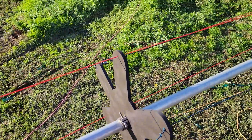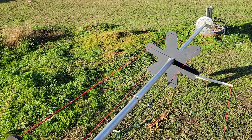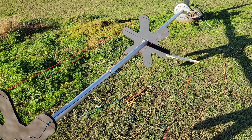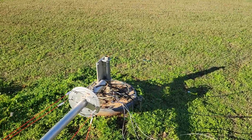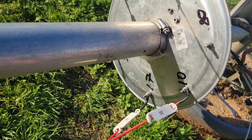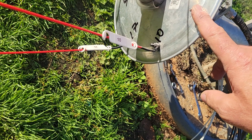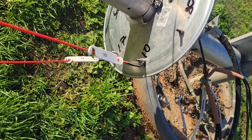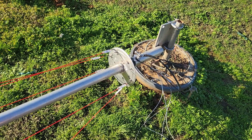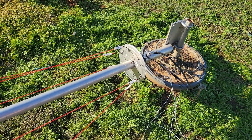I could use this antenna right now without doing anything else — every band's SWR is below 1.5 — so I'm happy with it. But here's another thing: I've got these extra screw places here, and I don't even have the 75/80-meter wire on yet. I'm sure when I do it'll change things. I tried moving the 17-meter wire before I extended it away from the pole, and it threw everything off. I put it back and really thought about it — I looked at my harmonic chart and could not find a harmonic. I was thinking maybe 17 meters was a harmonic of 60 meters somehow — it's kind of close, but it's not.